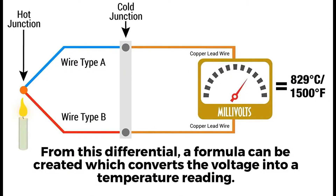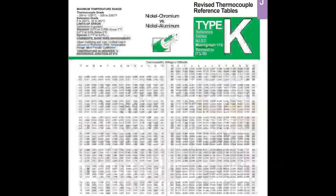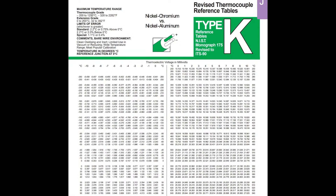The thermocouple is made with two wires and a weld in the center. To measure those millivolts, you need something that can convert them back to temperature. If you have a very good ADC, you could put the conversion table into your code and do the conversion yourself. But there are also a lot of chips and sensors available — USB data loggers from Omega or DigiKey, or just search for a thermocouple and select a semiconductor. There are tons of chips from Analog, TI, Maxim, and others. You can roll your own K-type thermocouple reader, but you can't plug this directly into your microcontroller — you do need something that converts that millivolt signal to temperature.